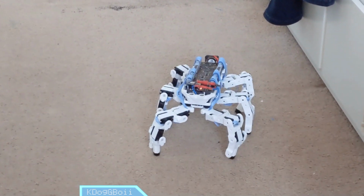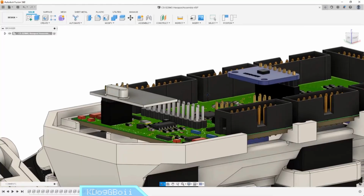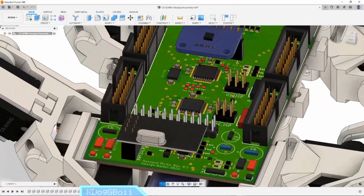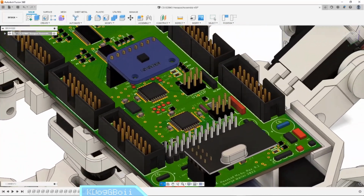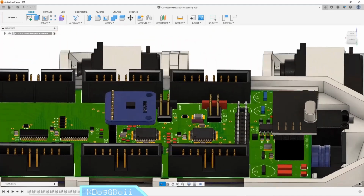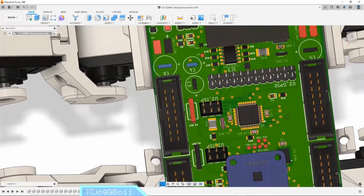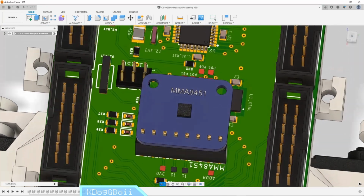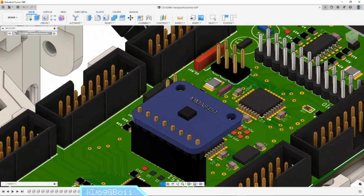I managed to battle this issue by taking a more hardware-conserving approach to writing the firmware, and splitting some functions, such as the radio control, to a separate microcontroller. I have asked a lot of the 328PB in terms of floating point arithmetic, and I've had to use some pretty neato tricks to get all of the functions that I need out of it. But it's detailed enough that I'd prefer to talk about it in its own video, if anything.